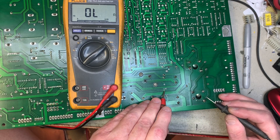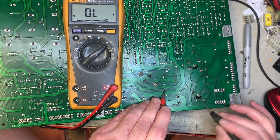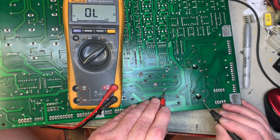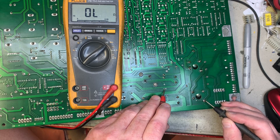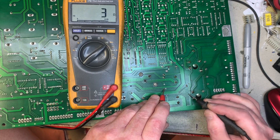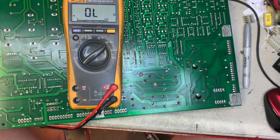You can also check the connections because somebody has replaced this bridge rectifier here too. Connections from the AC side of the bridge to the general illumination zero cross circuit — and at least those are working. So let's get into it and get this board repaired.